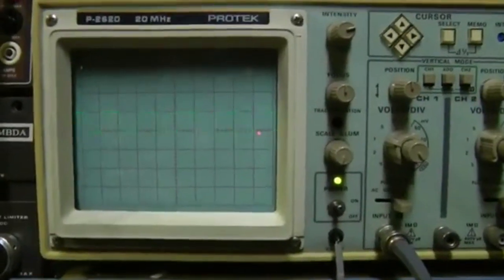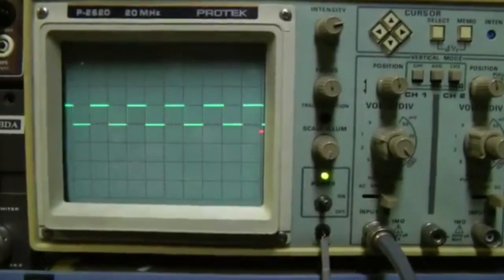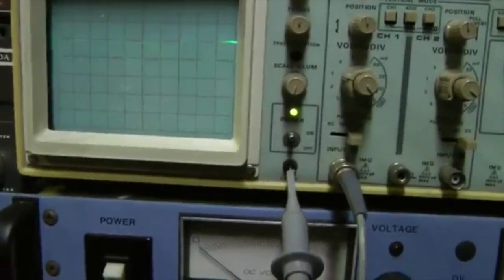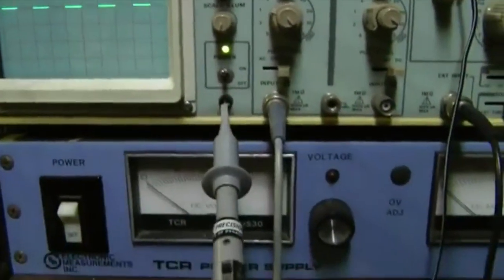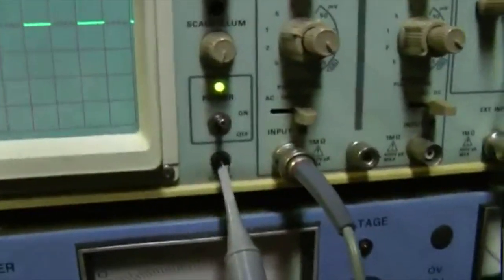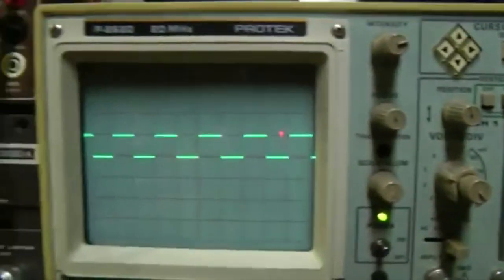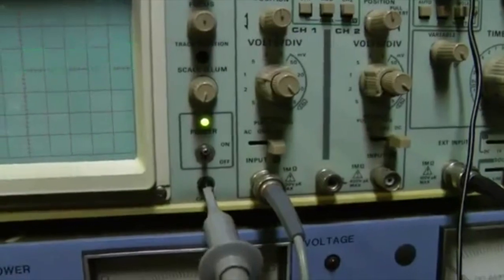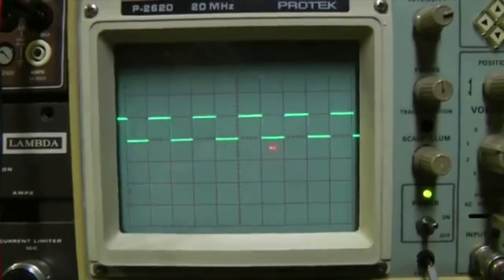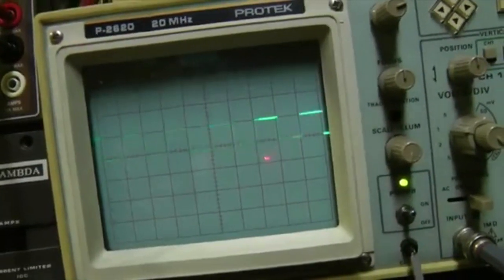Okay, I'm going to try to take care of as many things as I can with this video. Before I use the scope for the next part of this project, this is for the guy who insisted for days that my videos were no good because I haven't showed that my scope is calibrated. So you can see the probe here is on ×1. The divisions are set at 1 volt per division, and the probe is hooked up to the standard, and so you can clearly see that there's 1 volt per division and a good square wave. So much for that. I'll hook this up and we'll do the motor test.